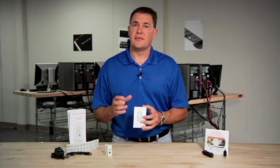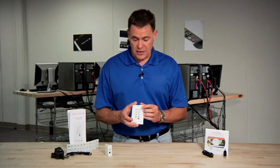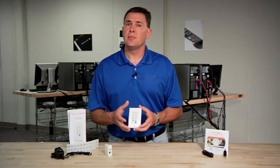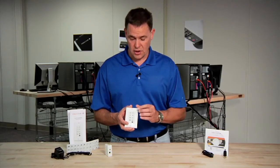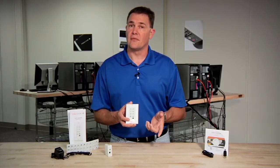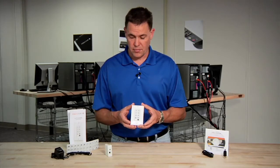With the fire all command, all commands within the stack are fired within milliseconds. The best example of that is the power off. Typically, powering off a projector requires two button pushes to confirm. You can program the off button so it fires both commands within milliseconds, turning off the device at the push of one button.